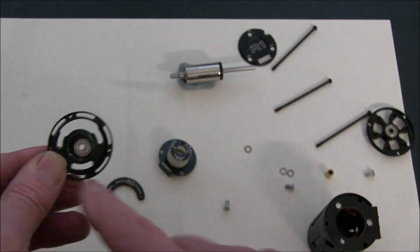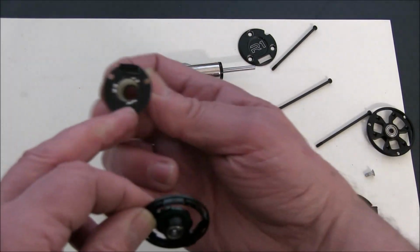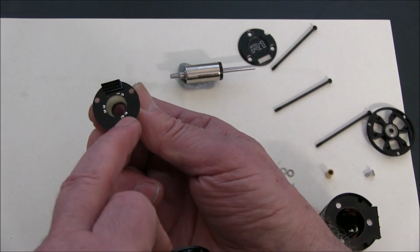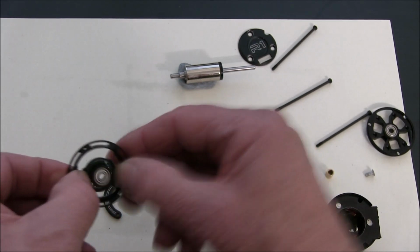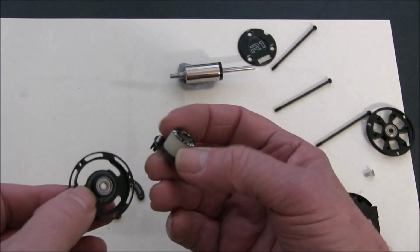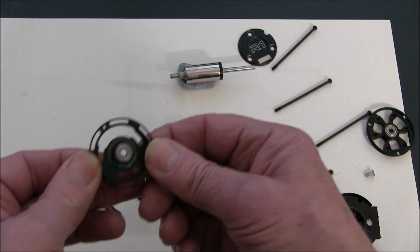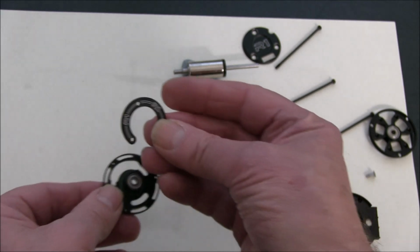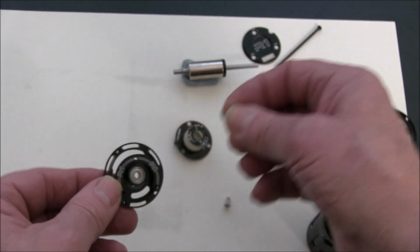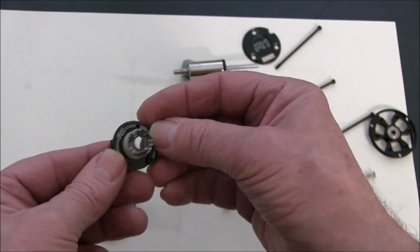And there's also a little bit of insulation tape put in around there to prevent these connections on the back of the sensor board shorting out, which has been a problem on some motors where these connections have rubbed through the anodizing and caused a short. Everything has R1 written on it. This little ring has R1, which goes on there, clamps that.